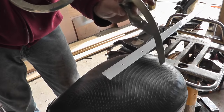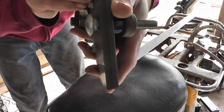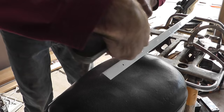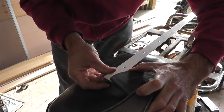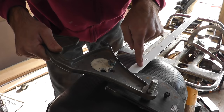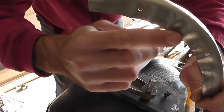My most ambitious failed attempt is a machine I fabricated. It's two pieces of quarter-inch plate cut in the correct curve with an arm that has a ball bearing mounted to it. My idea was to sandwich the piece of trim between the two pieces of steel and roll the ball bearing around it, making the curve I need without the inner edge crinkling. It was marginally successful, however I still have these cute little ruffles. This isn't a tutu — I don't want these ruffles.